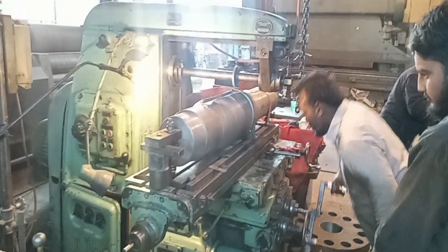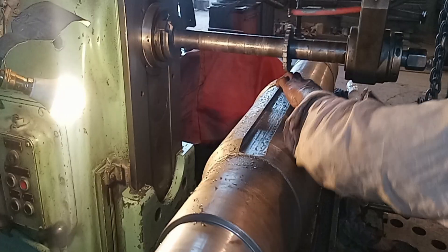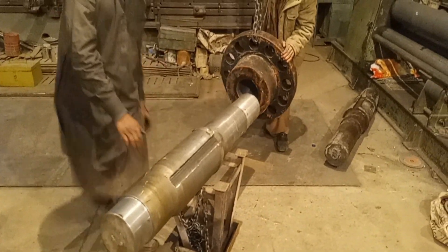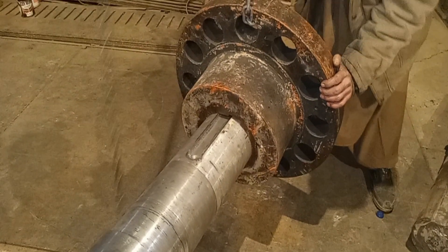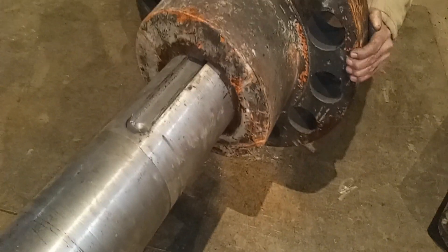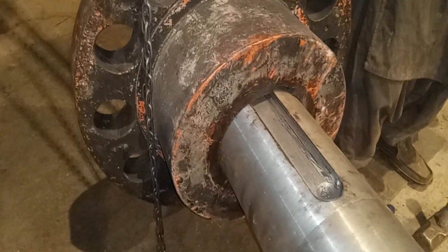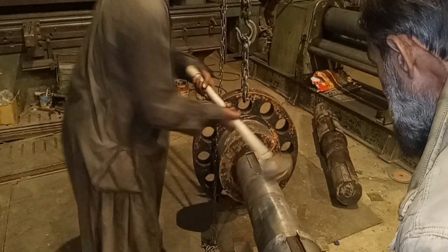The slot is machined very nicely. Now they are checking the work — first they are checking the coupling fit on the shaft, which is okay. They are using a hammer to push it further and verify that the machining on the shaft is correct. Finally they check the gear side, and the shaft fits correctly on the gear side as well. Please like, share, and subscribe to the channel — thank you very much for watching this video.